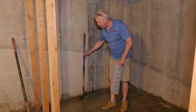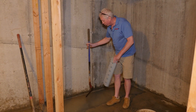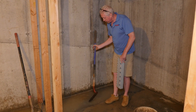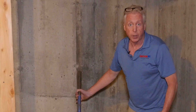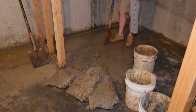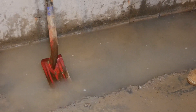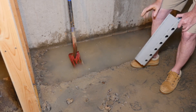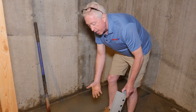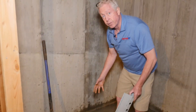We've removed some of the basement floor and we have a nice wide trench here. With this particular footing it's a little wider than a normal footing, which is about four inches — normal footing would end right around there, but this one comes out to right there, so it's about a foot wide. In order to accommodate that we had to make the trench much wider. You can see it's filling up right around the sides of the floor and over top onto the footing.